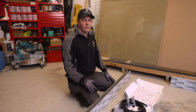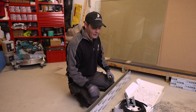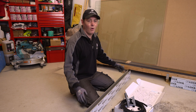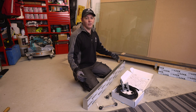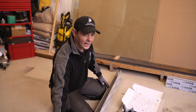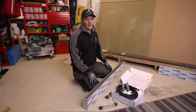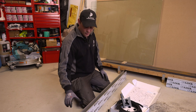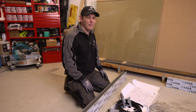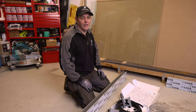Also — this is a minor one — if you're fitting a full 2.5 metre or 5 metre length of track without cutting it down and you've got a corner piece on the end, the gasket that comes with the kit isn't quite long enough to cover the corner as well. With a 2.5 metre kit you get exactly 2.5 metres of gasket, so if you've got a 200mm corner on the end you have 200mm less gasket than you need. I'm splitting hairs and being really critical, but we have actually fallen foul of this. To fix it we put a short extension piece of gasket on the end, but in my opinion it's not the best result for the customer — you want a full piece of gasket to make it look nice and neat.